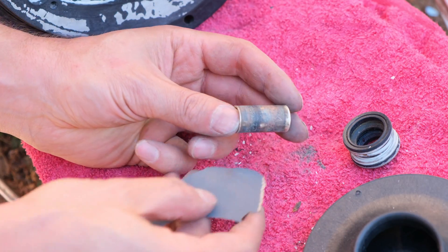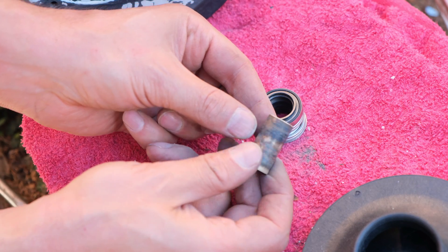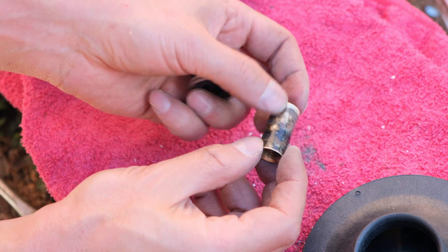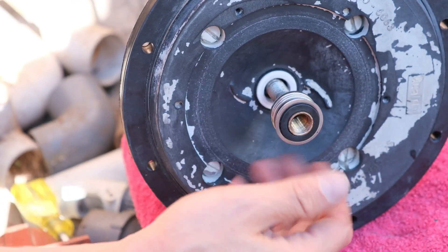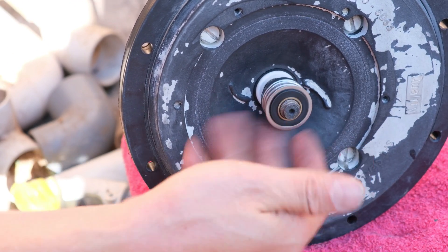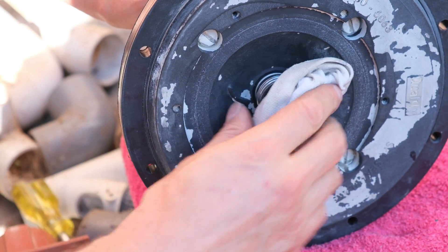The shaft is in much better condition now. I'll just use 800 grit to polish it and make it completely smooth. Now I can seat it in here — if it's a bit stiff, wet it first, then slide it inside. If your threads are rusted or difficult to screw in, put some grease on and make sure the threads have been cleaned up. Make sure the Teflon side mates with the ceramic ring, and turn it as far as it can go.